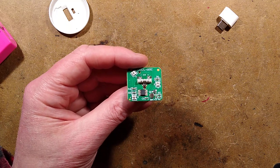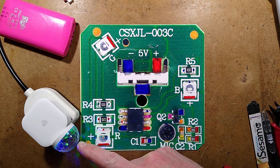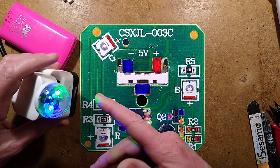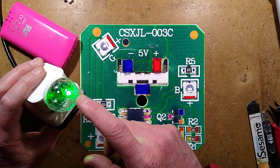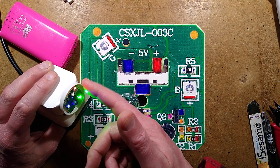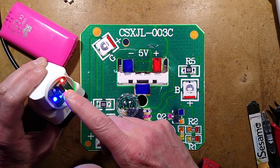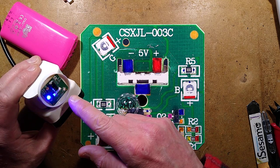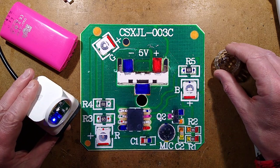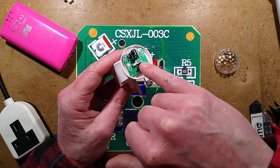There's a microcontroller, some resistors presumably for the LEDs, and a very basic audio circuit based on an electret microphone and some support components. It turns out this thing is slightly oversensitive — if you plug it into a power bank, the electrical noise of the power supply triggers it. Adding an extra capacitor works a lot better because it's triggered into that strobing mode when it detects a disturbance, usually the audio in the microphone.